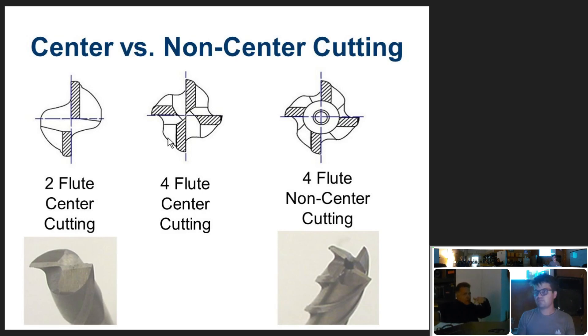On CNC machines, the bit will remain straight up and down but spiral the bit around in a path. You can spiral big enough so part of it will always have cut the area the center will go through. On a manual mill, you can turn both handles simultaneously for diagonal cuts, but that's really hard. Generally you tilt the workpiece or tilt the entire head of the machine to get cuts at angles.